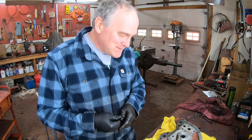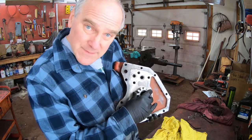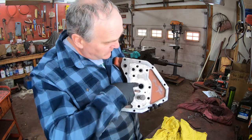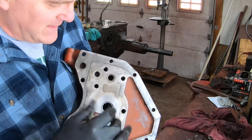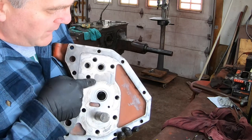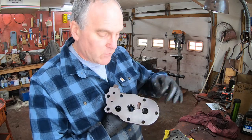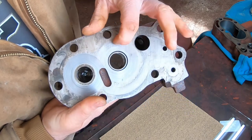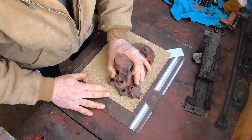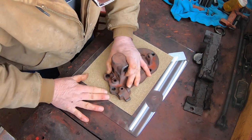One of the first things I did when I pulled this pump apart is I evaluated it for where these pump gears — the drive gear and the driven gear — ride on this plate. Over time, when dirt gets into the oil, you wind up with scoring like this. This plate is acceptable because I can't catch a fingernail on it — it's just surface scoring. The other plate, however, had a wear groove in it. To keep things perfectly flat, you put a piece of float glass down, which by its nature is perfectly flat, and then I used varying grits of sandpaper to smooth out the plate.